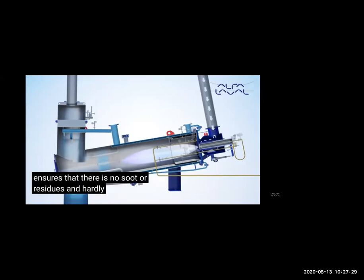The gas which is generated in the exhaust is inert gas, and we will use it for putting in the tank. So there is hardly any carbon monoxide or carbon or any other impurities, because we are burning the gas very nicely. But it has to be cooled, because of course it's burning at such a high temperature. So the gas will be hot. We have the scrubber where it is cooled.